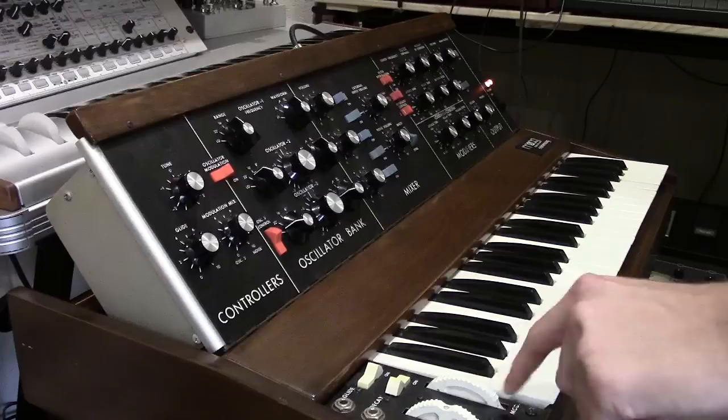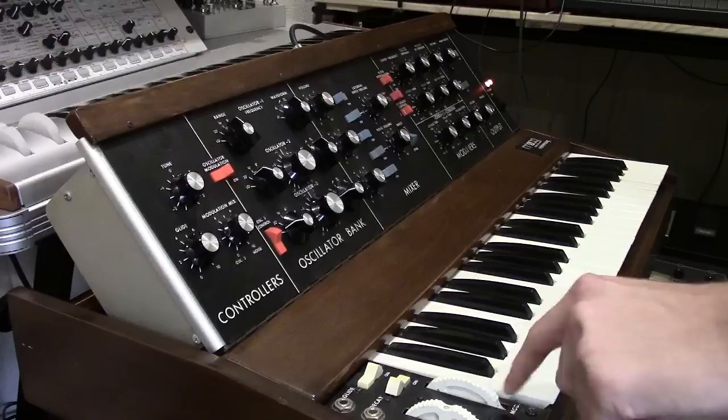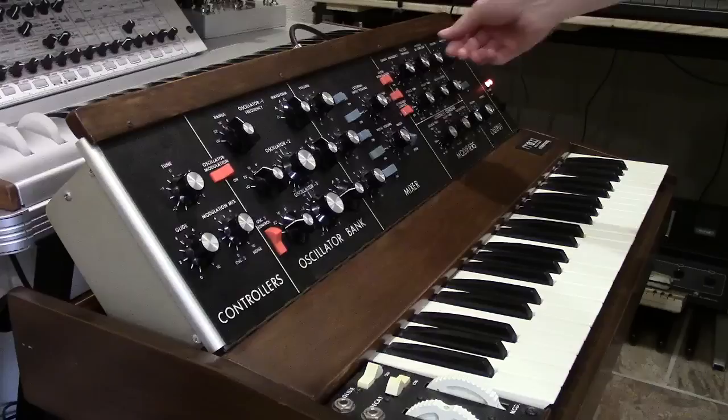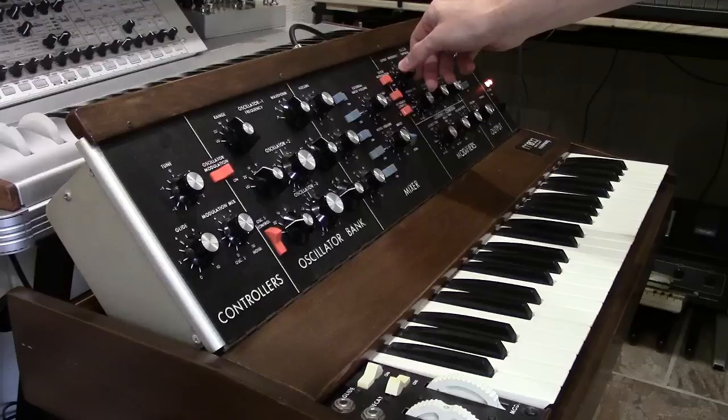And that's Pink Floyd! So that's working right now. I actually found you a new old stock Allen Bradley 50K audio taper pot, so it's got the factory-style pot in it. It was actually cheaper than a new Honeywell pot, which would have been the same thing. So I just got you back with Allen Bradley — all matching there now.